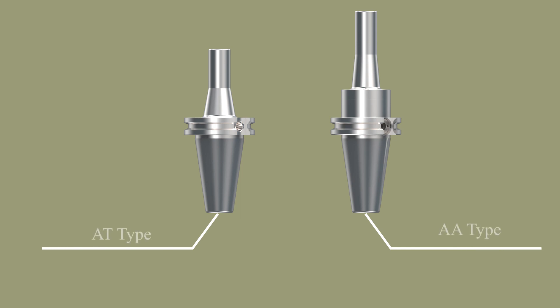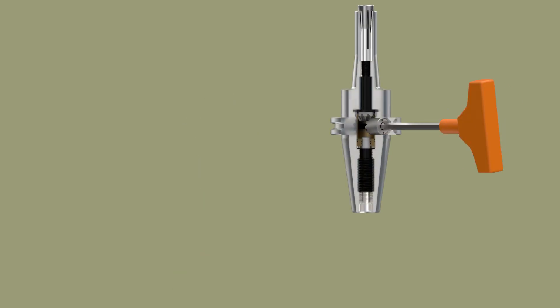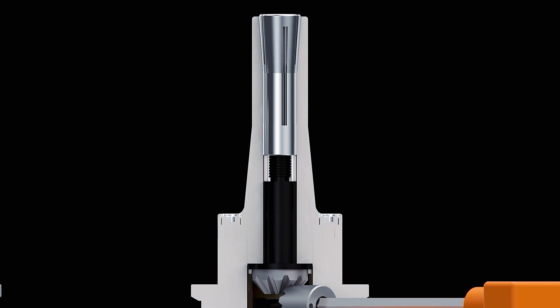First, let's look at the collet system. The collet is threaded at the base so it is pulled in by an easy-to-use mechanism that only requires a wrench and about 15 newton meters of torque. This mechanism, along with the eight-degree collet system with extended length and rear pilot location, allows for quick changeover, providing more versatility while also providing rigidity and grip force.